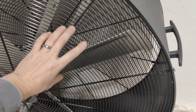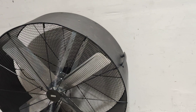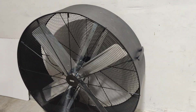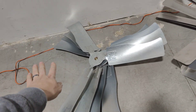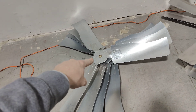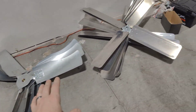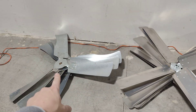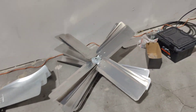Once it cracks the whole thing will just rip into the plastic, get stuck, the motor stops, and the whole fan will be down until we take it apart and try to fix it. So we came to the realization that we actually just need to replace the entire propeller — put one of these guys on there — and these don't crack at all. After we did that we could start running at maximum speed, because before we couldn't run at maximum speed because of that cheap fin.